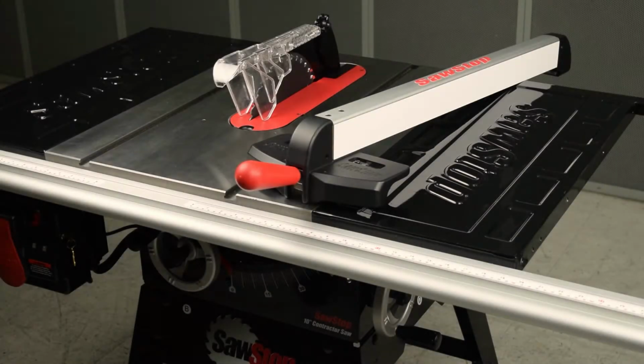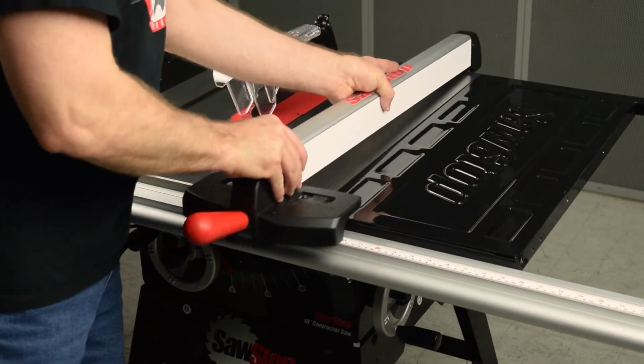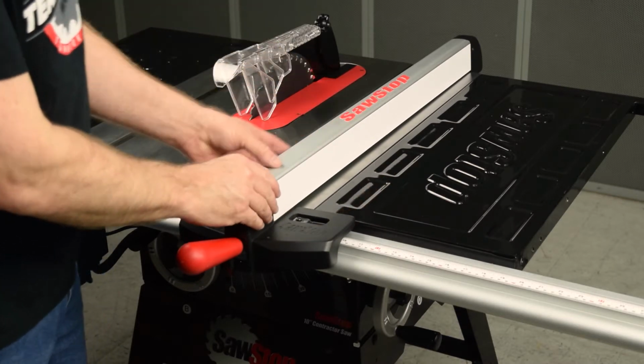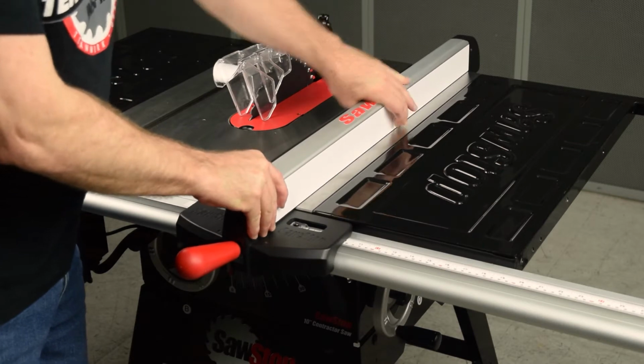First, confirm the fence is locking properly, but before proceeding, make sure you're placing the fence correctly. To place the fence, first hook the rear clamp on one of the rear rails. Then lower the fence head onto the front rail. Make sure the rail glides on the fence head are fully in the guide slots.